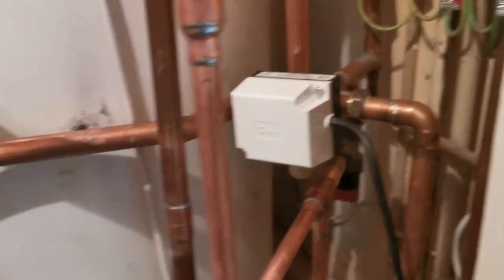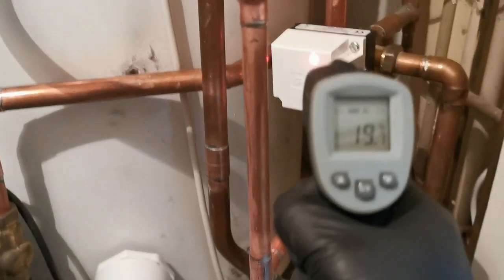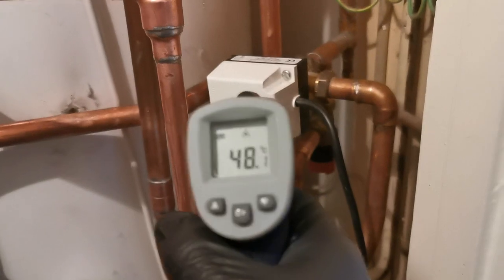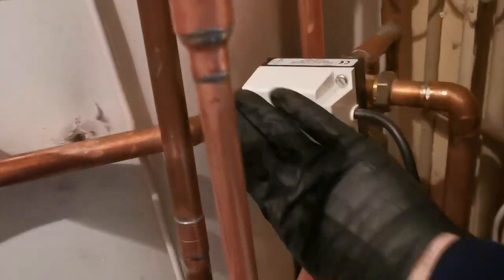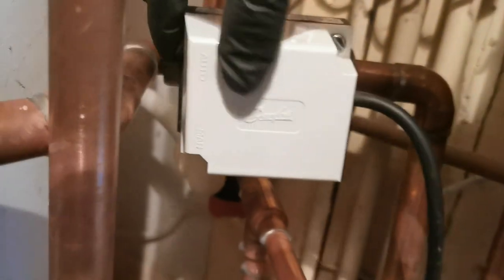Like all these tips, you can't just take them as gospel — you need to do some other checks as well. But if zone valves, pumps, or other parts are hotter than usual and you can't touch them, that's usually a bad sign and a telltale indicator that something is at fault. Again, do your multimeter checks.